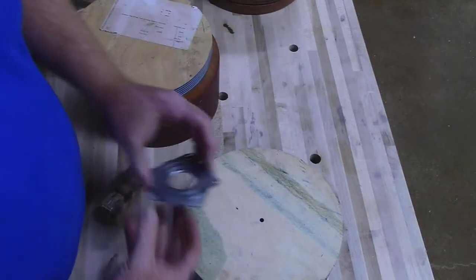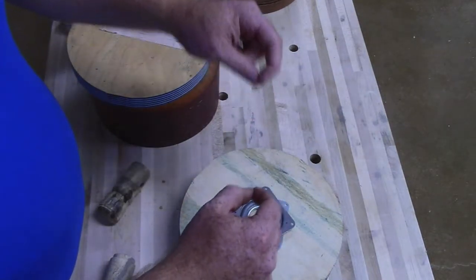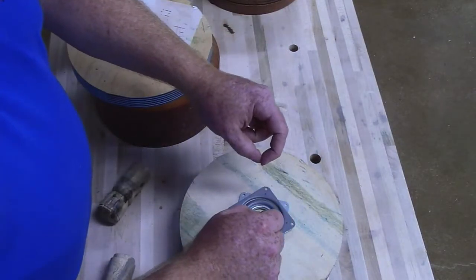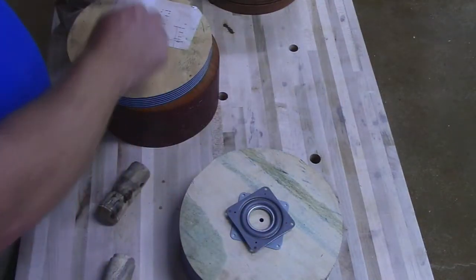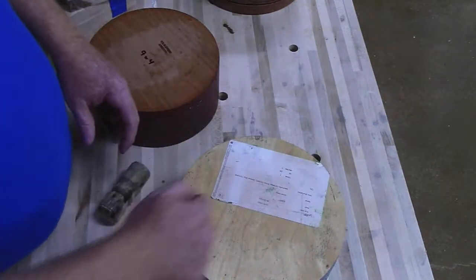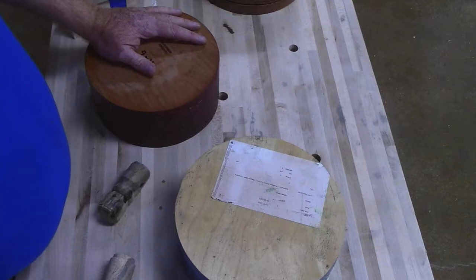You first drill this into the base or into your top piece, and then I use the holes that I have pre-drilled. I use, what are those things called? Barbecue skewers, shish kebab sticks. I stick them through the holes here. I get them lined up there, hold it, line it up, so we have the holes come through so I can drill the holes in. Because trying to blind drill those holes from the bottom into that little tiny spot's a pain in the butt.